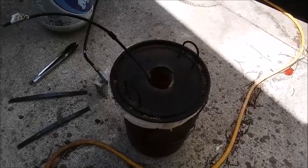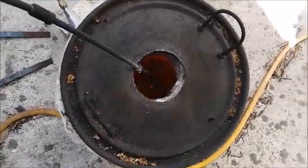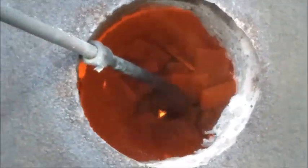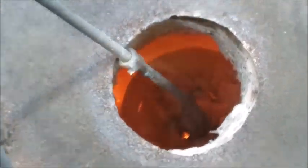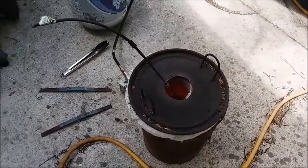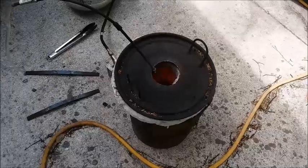The flames have died down a lot — the bulk of the stuff has burned off and I can see down inside now. What's interesting is in the past the crucible would have a kind of uniform glow, but now you can see that down at the bottom of the crucible where the air is coming in there's a brighter glow. That's the plastic of the chips burning down in the bottom of the crucible where it didn't burn before. That plastic didn't burn down there before — it just pyrolyzed and turned into black carbon or charcoal.